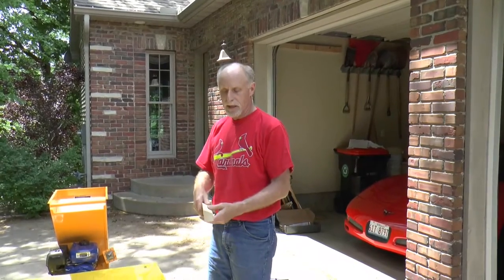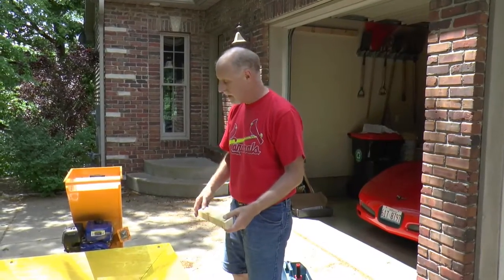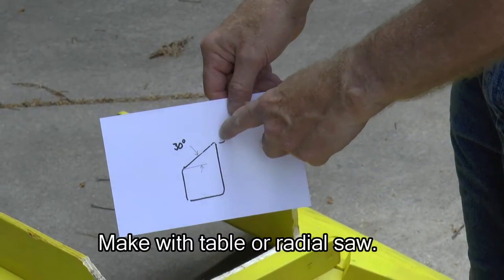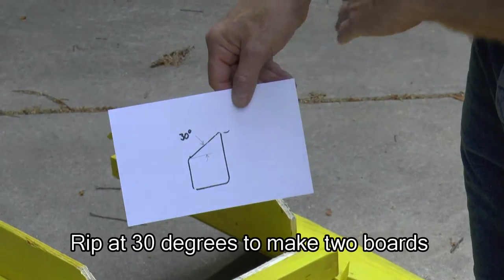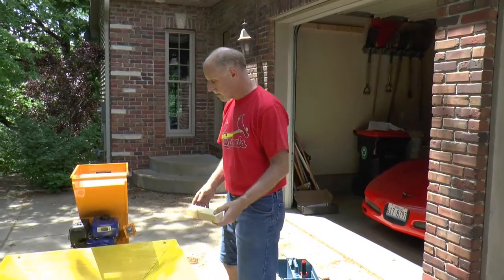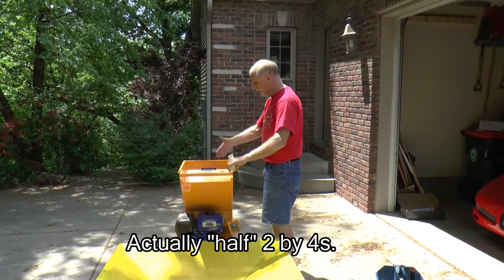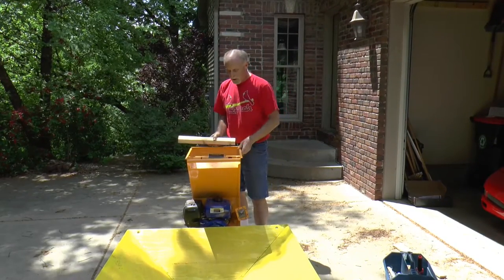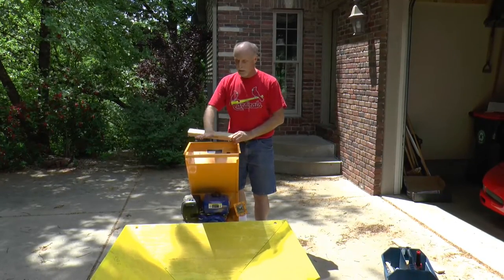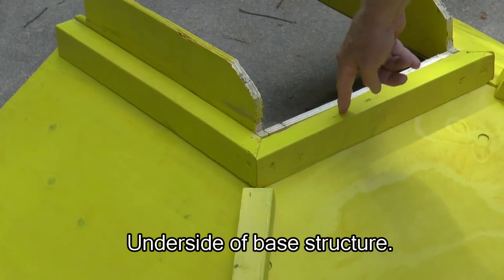What we built this out of: we take some two-by-four and we put a 30-degree cut on it so that this gives something for the plywood to screw into on the top. So this is the cross-section of the two-by-four I used — typical with a 30-degree angle on it — and that's where the hopper body sits up on top of that. We make a frame with this two-by-four that sits on the top lip of the Harbor Freight, then cut a 45 on it so you've essentially got a miter cut into the corner. Once this frame is made around the top, the weight of the hopper is resting on the top of the chipper shredder.